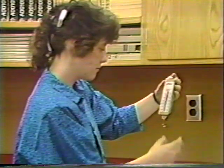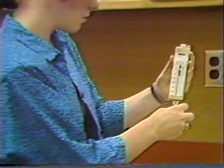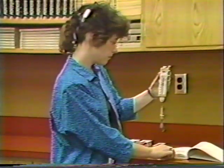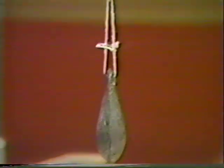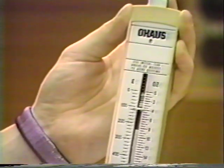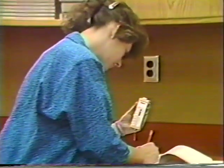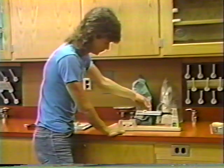Because balance is a delicate thing, be careful with this equipment. You'll find several types of balances in the laboratory. A simple spring balance uses a stretching spring to measure mass — once the zero point is set, just hang the unknown on the hook. This type is not appropriate for work requiring great precision. You should choose your equipment based on the size of the error you can tolerate. If you must measure to the nearest tenth of a gram, you need a balance accurate to tenths of grams or smaller gradations, perhaps like the triple beam balance.